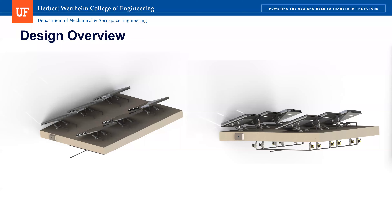Moving on to the design overview: our design utilizes six modules, each with a reflector, to provide a solar concentration ratio over a thousand suns. We also use two linear actuators on each reflector to rotate about both axes, as well as solenoids that control these actuators. It also consists of a concrete base to mount all of these onto.